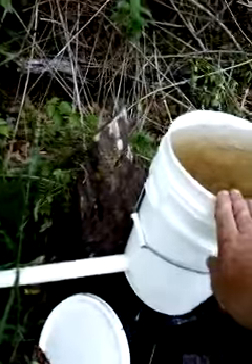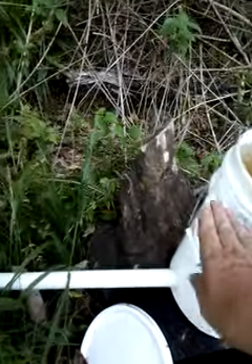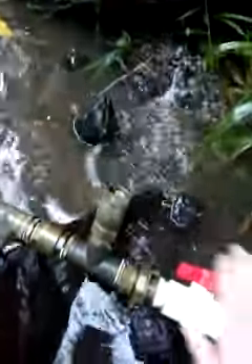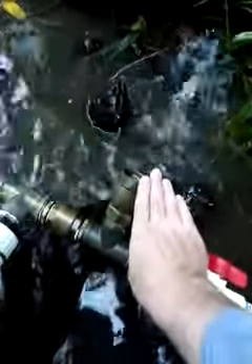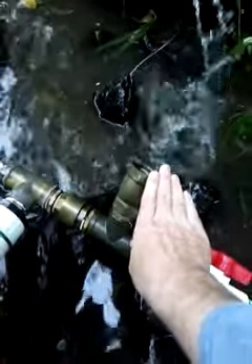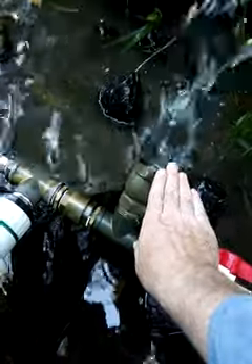From that height, the drive pipe comes out the bottom and the water runs down. I've got it going down about a meter thirty at the moment into the bottom of the ram pump, which is just above creek level. So effectively I've got the flow dropping from the top of that standpipe drum back there down to that point — that's the height it's dropping from.